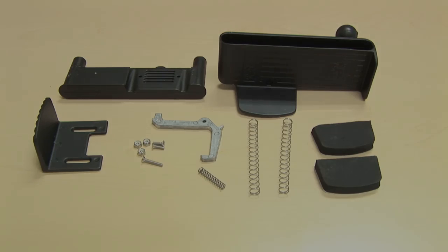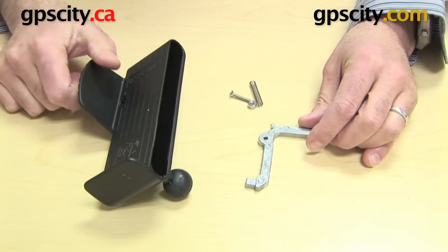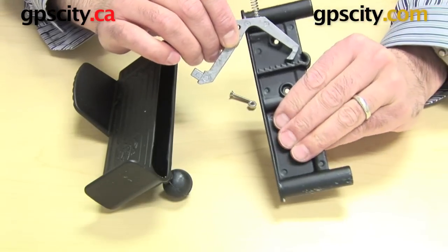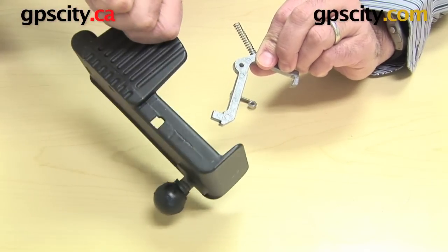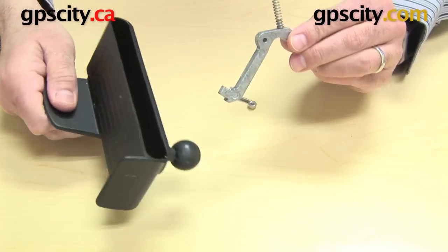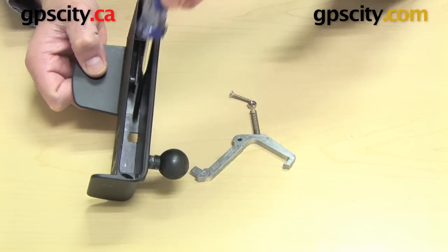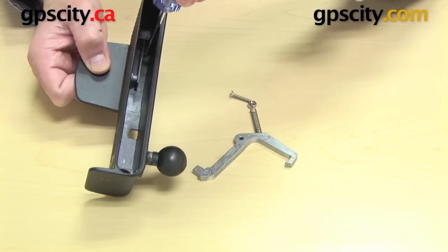Now I'll show you how to put it together. The first step is to get the latch lever inside the cradle. We need the small spring, which goes into the little notch on the lever. This part of the lever clips onto the grooves on the other side piece we'll install later. The little release button sticks out the side — when you press it, it releases the side clamping function. The spring will catch itself into the top part of this piece.